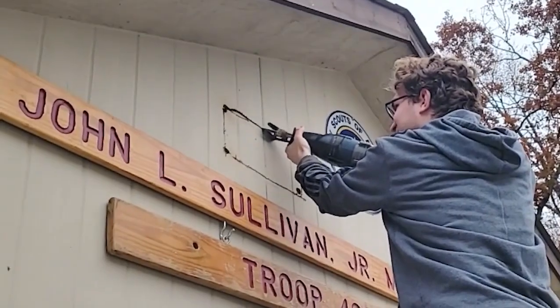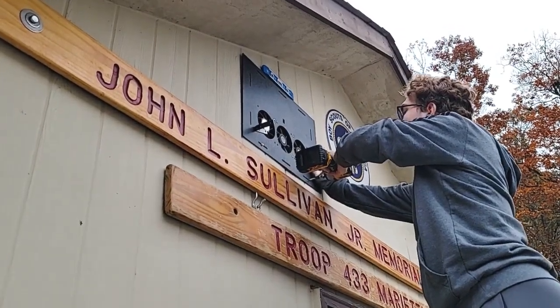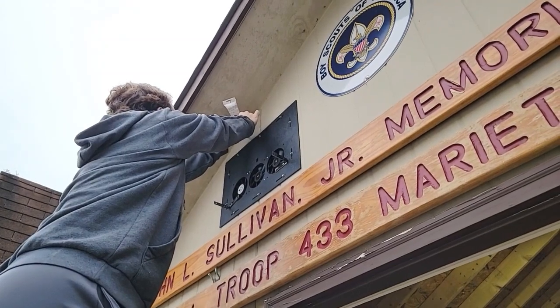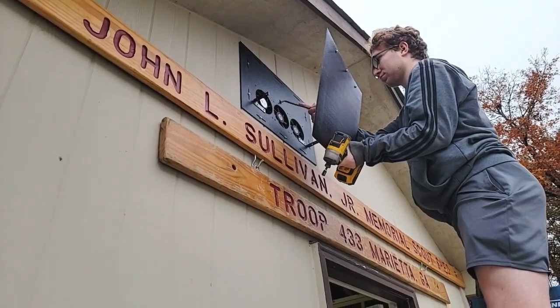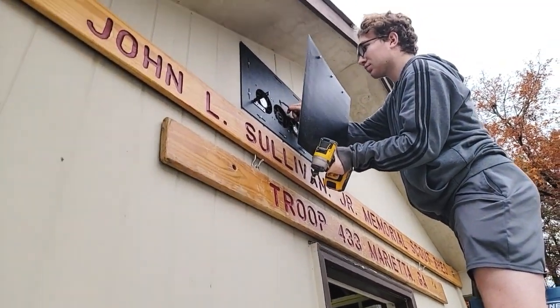From there it's pretty easy. There are two different parts. You've got the fan itself which has the frame on it, so we screw this in place from the outside. We're going to use some sealant — the sealant goes around the edges of the fan to make sure that water doesn't get in from driving rain. Once that's in place, we're going to slip the wire through the hole in the fan so we can wire it up on the inside and then attach the solar panel.